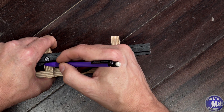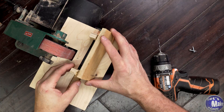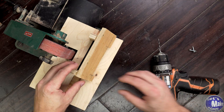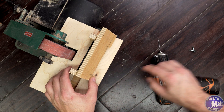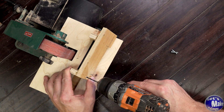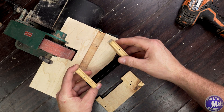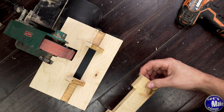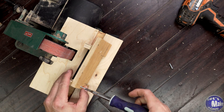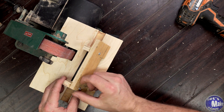What we need to do now is cut off both of these ends. Now I need to glue my fence to this, but the problem is that this is a very difficult angle to actually clamp down. So what I'm going to do is drill a hole through the front — I'm going to add two screws, but really they're only there to clamp it. I still want to use glue and then remove the screws when I'm done. I added a little bit of glue earlier just to glue-size this a little bit, which fills the pores up on the plywood. I can stick this on here and add my screws. We'll give this some time, come back, and we'll add our last final strip.